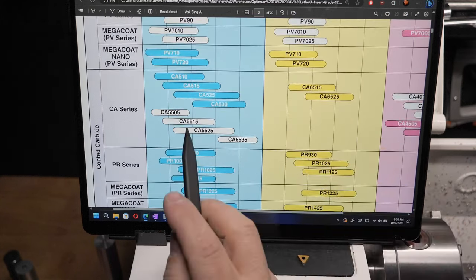Now, what about the infeed? I'm going to skip the depth of cut here. We'll go back to that in a moment. But the infeed, that's the speed that the carriage moves across at. We already know that this is set to 0.11 because it says so on the front. And that's the slowest possible speed.